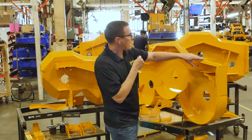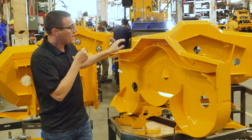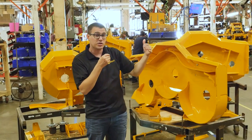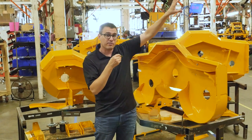On the nose of the deck, we have several different styles. This bull nose shape here allows us to maintain good clearance for cut quality, but also keep the caster wheels closer to the deck so the machine can be shorter. These wheels also have better control over the cut height of the deck than if they were further away.